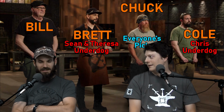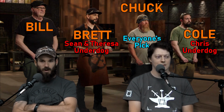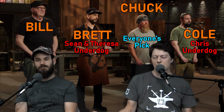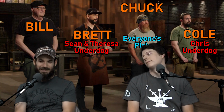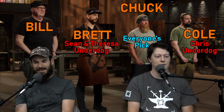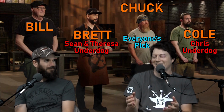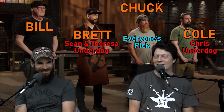Jay Nielsen was just like, you took any hardness you put into it using that differential heat treat right out by doing that. Any partial hardness that there was is now gone because it was heated up and then softened and not up to temperature enough to be effective. And that was the point where Doug came in with that comment. They're talking about how by doing that, the heat treat's gone, the blade's soft, and then Doug says, "Oh, it's just a tip."